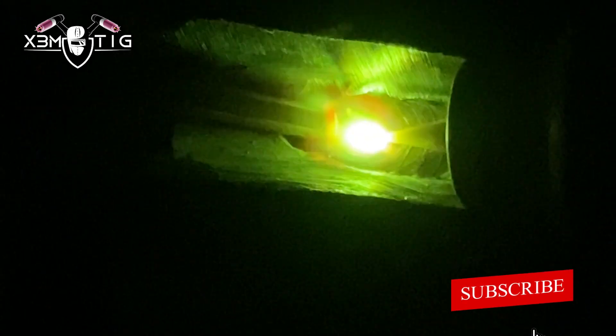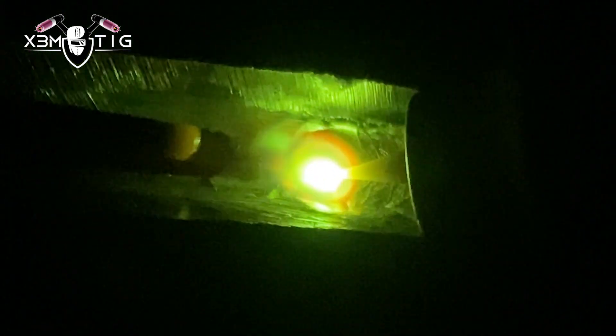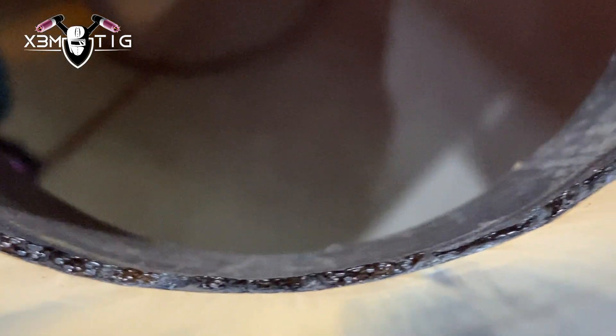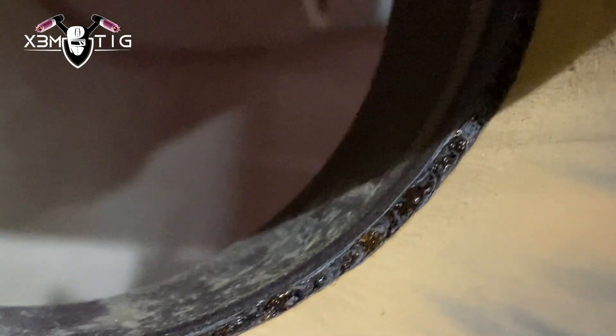It's pretty much like any tie-in: just pause a little bit here, top and bottom — more at the bottom than on the top in this case. Just add wire as needed, and then stop at the middle. Now I've got about three-quarters of the root done on this pipe. I'll show you one more view so you can see the build-up and uniformity of the root.